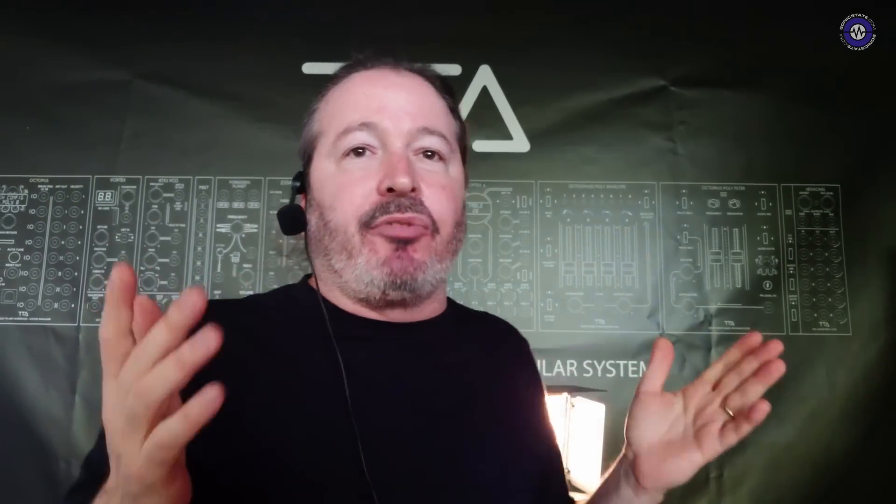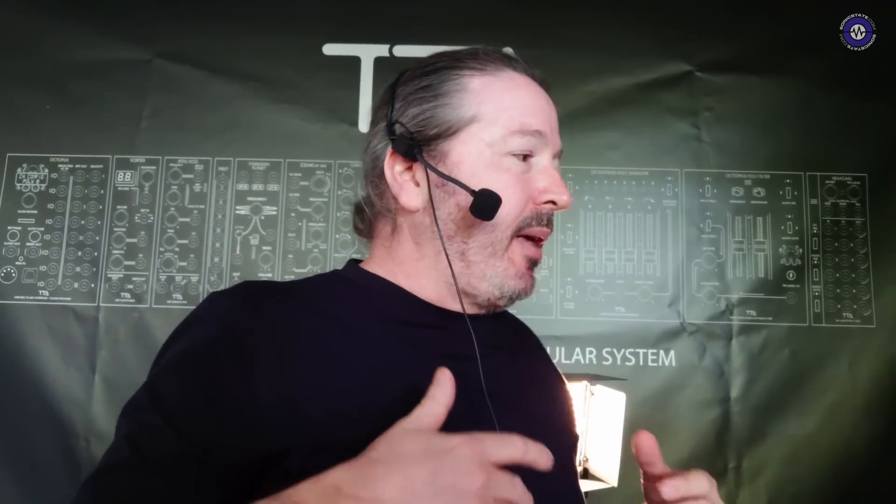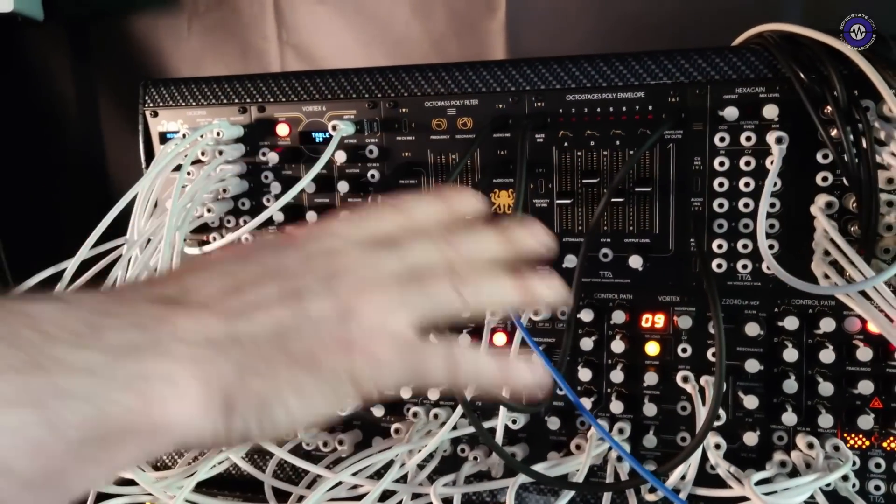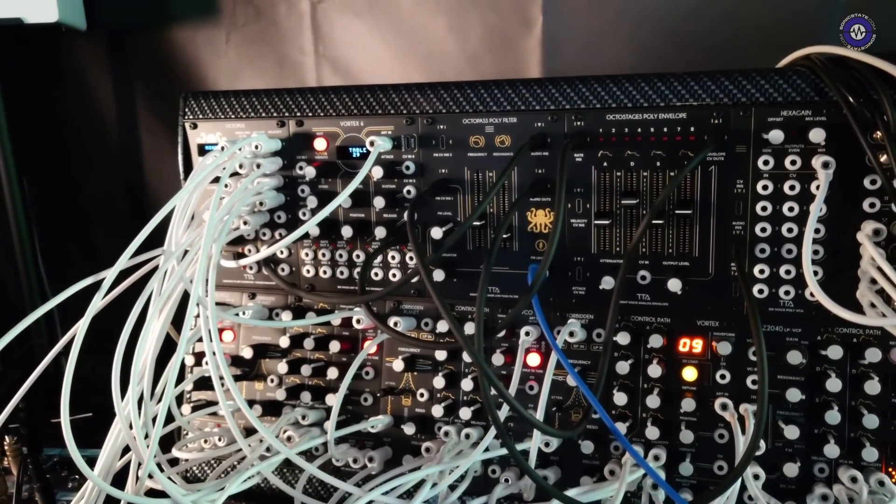So is it bi-directional on that cable, listening back? No. The ART signal itself is unidirectional, and all it sends are just commands. People try to compare it to MIDI — there is some similarity in the way the commands are set, but there's no configuration. You patch it just like 1V/octave: you go from your controller, sequencer, whatever, into your oscillator — that's it. What's going on inside the cable is not different for the user than how 1V/octave was. And the audio signals are just normal audio signals. Everything is standard CV, gate — same standard to your rack. There's no change to that either.